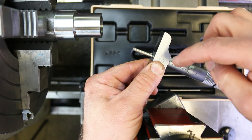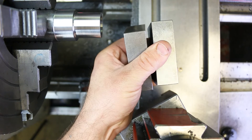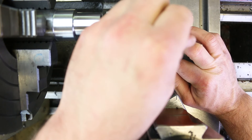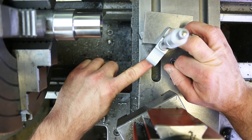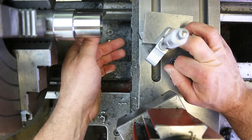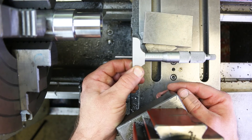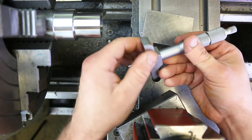When you back this out so the zeros line up, that should be one inch from the end of the rod to the base. But with so many interchangeable pieces, you won't always get a perfect repeatable zero switching between rods, so each rod really needs to be zero-set on its own. The easiest way is to use one-two-three blocks. We use the one-inch dimension — put the base down on top of one block and run it down until it touches the other block. You're measuring from a flat surface to a flat surface, parallel and exactly one inch apart. We're a little bit off — I'll adjust that using the spanner wrench in the spanner hole to rotate the sleeve with the graduations.